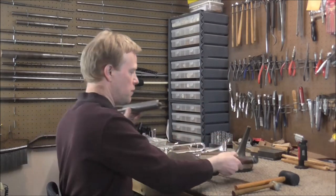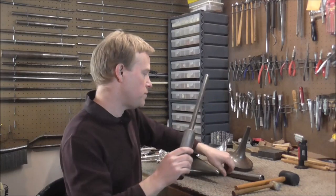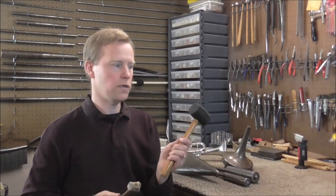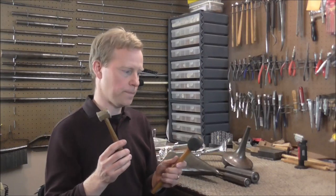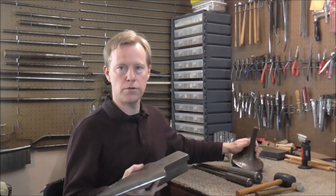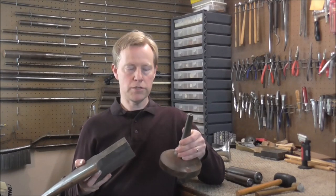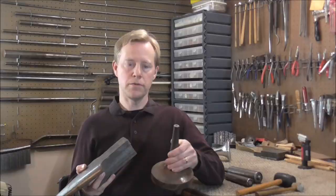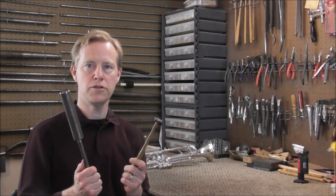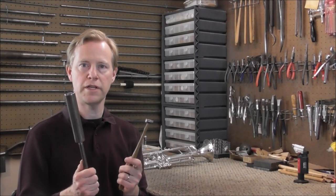I also have a larger dent roller for large brass bells, but for trumpet it's almost always the small dent roller. The other two tools I often use on bell flares are the rubber mallet and a rawhide mallet. I usually do not use these mallets by themselves but in conjunction with one of the other tools. They also work better on metal that is very hard, and the Bach Stradivarius trumpet bell metal is very soft, so when removing dents on these trumpets I rarely use those two tools because it's usually not necessary. Towards the end of the repair I will probably need a small dent hammer, but that leaves us with just two tools — usually the only two you need to fix the bell wire dents on a Bach Stradivarius trumpet.